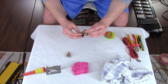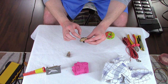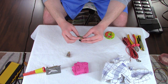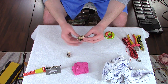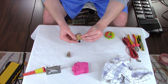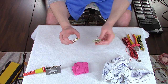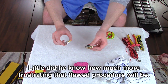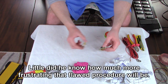Okay, and then here with the pickup switch, I jumpered those two connectors together. And the other three are representing position 1, position 2, and position 3. And the pickups will be connected to those. Okay, now we gotta put those two into the guitar and then connect the input jack and then connect the pickups and then we're done.